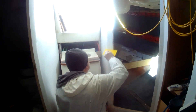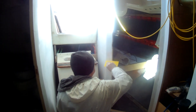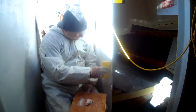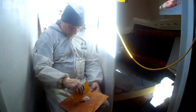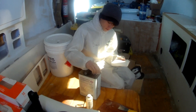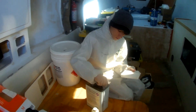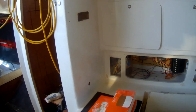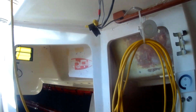Dad's putting another skim coat on top of the paint job to fill in all the cracks, then we sand and paint all over again. We're using acetone to clean down everything and all the tools in between. We finished another skim coat all the way around, up the wall. This one here is pretty rough — probably two more skim coats needed. This part here is going to need a lot of sanding over the top, and these corners were a bit rough too. David is mixing up the last of the F26 compound — I think we've done one good layer.